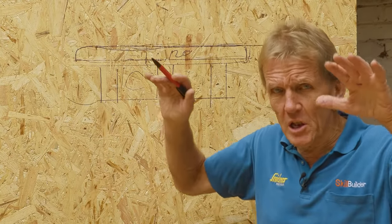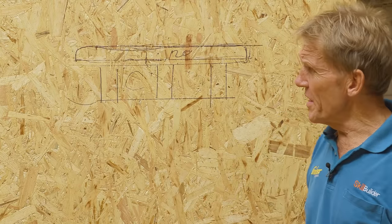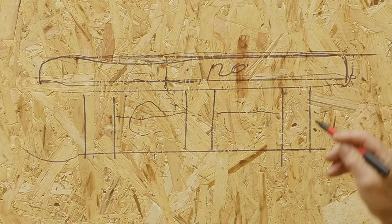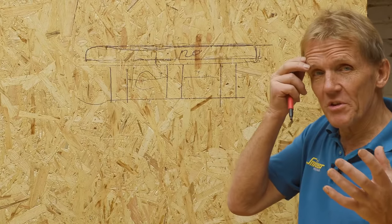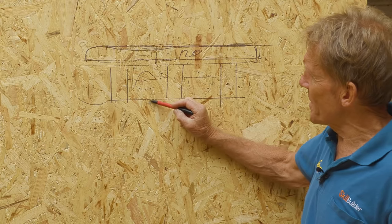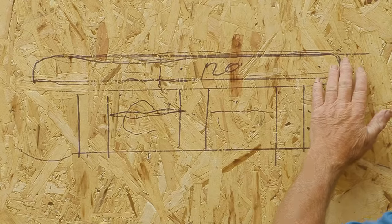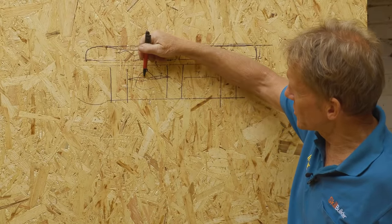But we're not doing a warm roof because we have to lower it down — that's very often the case, people haven't got unlimited height to work with. So they've got to put their insulation within the joists. We've got a 9x2 joist here and we could pack that void full of insulation, except for one problem: we're still dealing with the same physics. Nothing has changed. Airborne moisture coming up here — if it gets through the insulation, it's going to be on the cold side of the insulation, because there's no insulation on top.